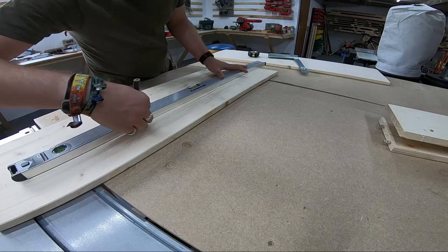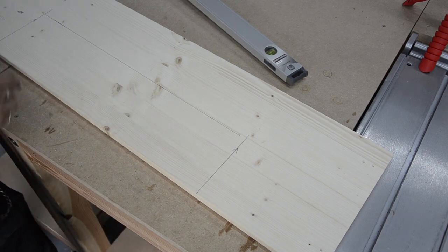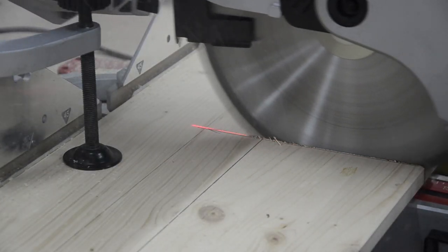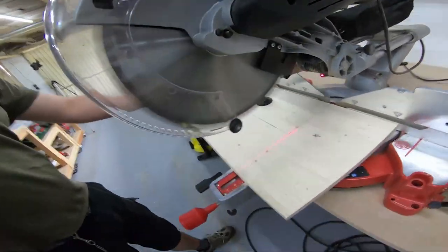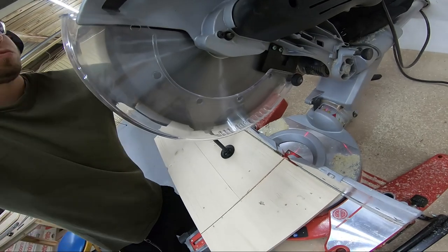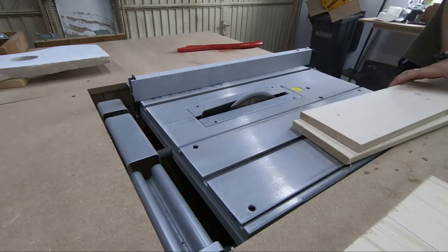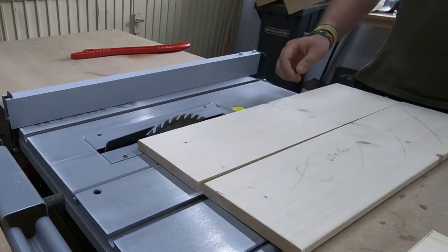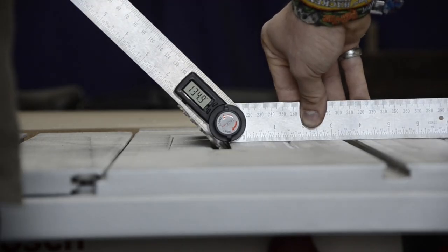The wood still had holes and beveled edges from earlier projects, which I had to cut away. At the table saw, the two side walls are created quickly. For the frame, I had to make some miter cuts, therefore the saw blade must be tilted to 45 degrees, or 135 depending on your point of measurement.